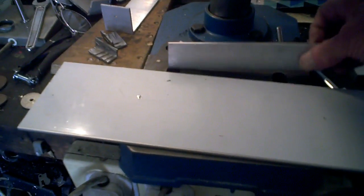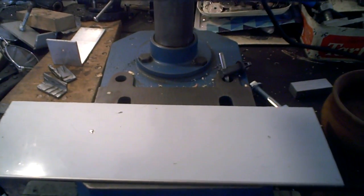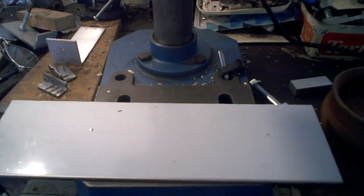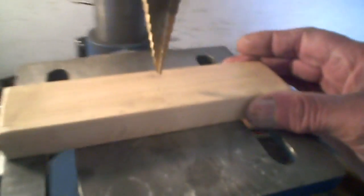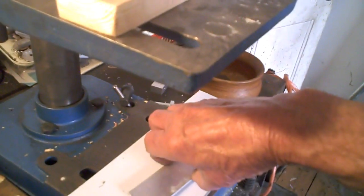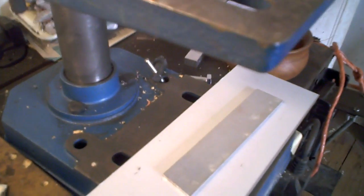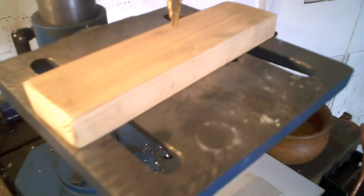And then, as I say, I've got plenty of these offcuts, two small pieces like that, and you can clamp them on. So what you can do is hold them without marking them. That's the thing. Doesn't matter if you put a slight mark on, but aluminium is best to hold it on. And that's strong enough, because that other one, as I say, they moved. So they've got to be held securely and straight, but not move.